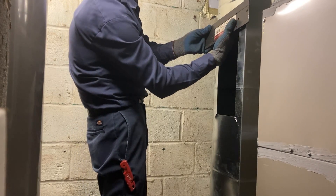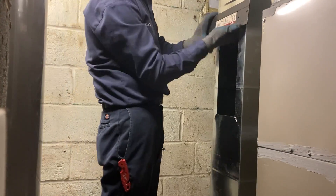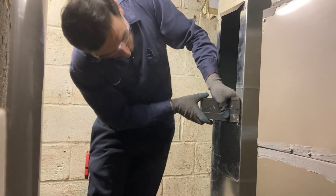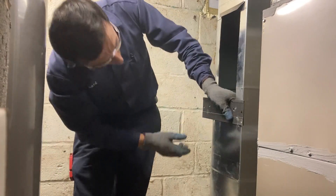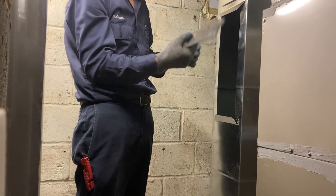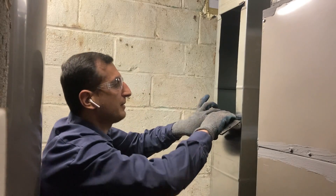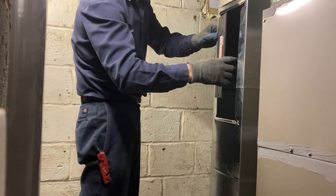I'm going on my 1-inch side first. I'm kind of breaking it but not fully bending — maybe 15 degrees, something like that. Same thing on the bottom. Just to have this brake line that will make my life easier in the future. Then you switch to the 3/8 side and go all the way around — bend 180 degrees. Same thing on the bottom. Now you can go to your 1-inch side and bend this open.